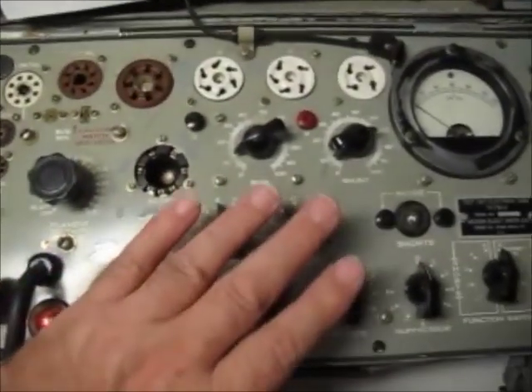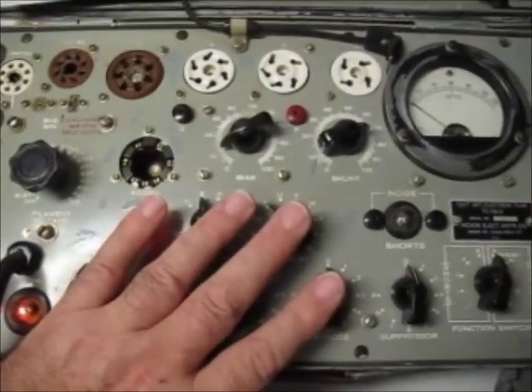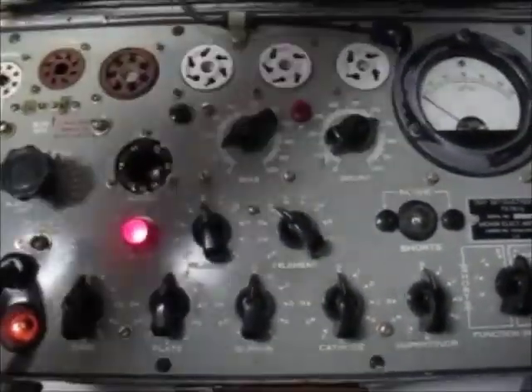If you read the book, you'll see that beside each valve there's a set of switch settings. In this case it's FT4-1200, and there's also a set of ballasts. The base switches set the wiring for the valve you're going to test. I have some 6BA6s here that I've tested before — I tested them a few months ago and I believe they're okay. So I'll go back to the book and look up the 6BA6.